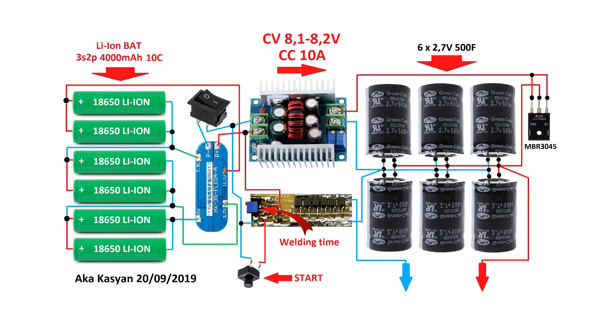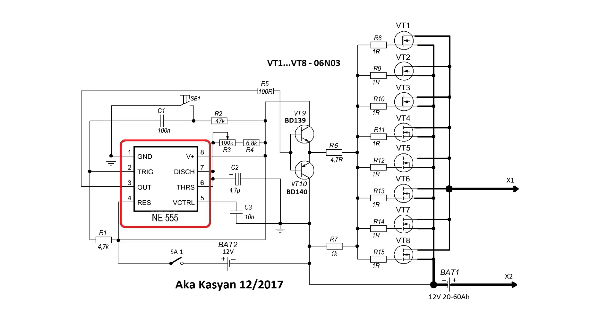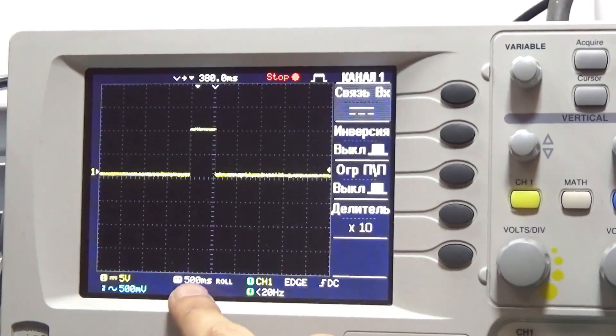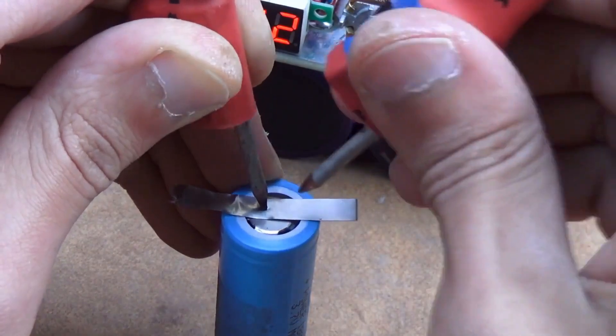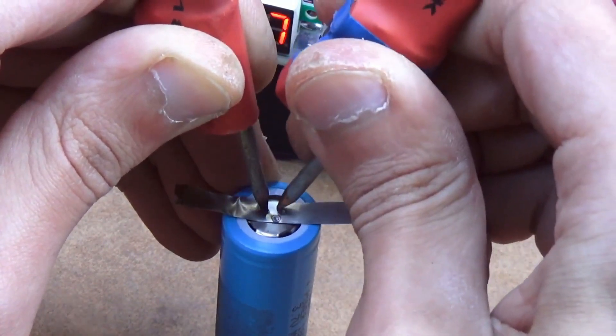Let's start with the last one. This part consists of a series of powerful field effect transistors, which are controlled by an NE555 timer chip, but not directly — through a driver. The concept is simple: we have a powerful battery, and when we press the button, the field effect transistors are activated. The power from the battery goes to the welding point. The welding time can be set from 50 milliseconds to 1 second by turning the variable resistor. When we press the button, the pulse goes for the set time regardless of whether you release the button or not. One press, one pulse — everything is just like in an industrial machine.